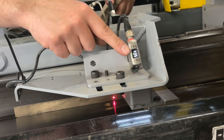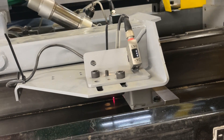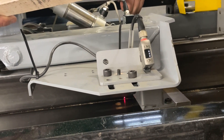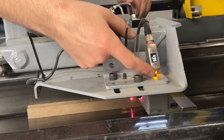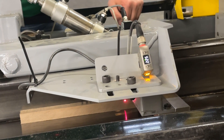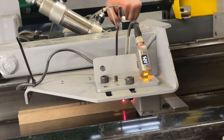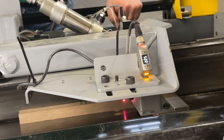You should see it flash 'set' after that. Then replace it with the thicker piece of lumber, which is indicative of what your target is going to be for the sensor. With that in place, tap set again. You should get a number flashing — that's your threshold. When the measurement is above that, it will trigger the sensor to turn on, showing that there's a board in position. When it's below that, it will turn off, showing that it's reached the end or the beginning of the board.